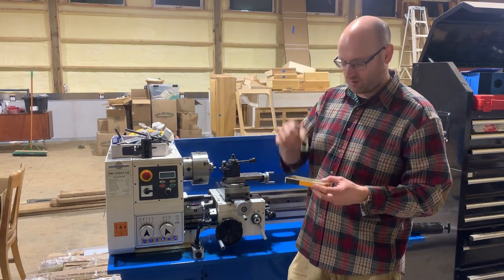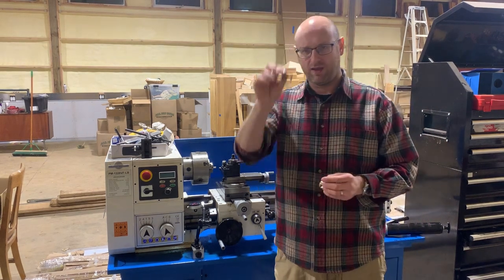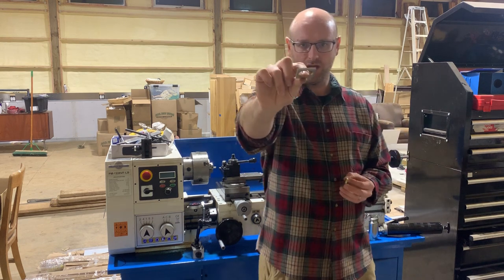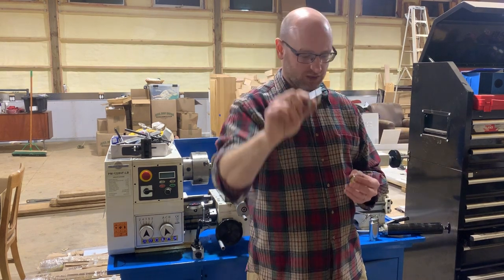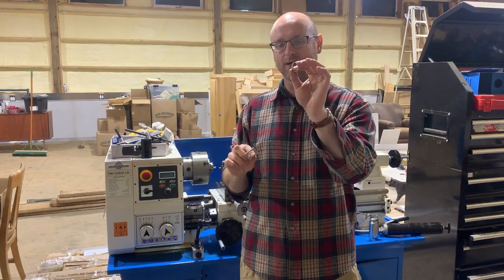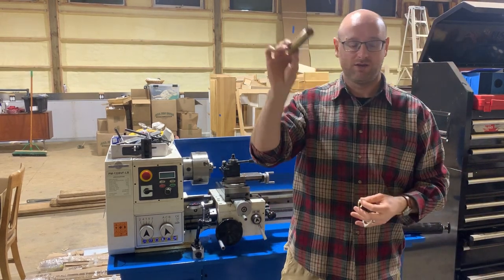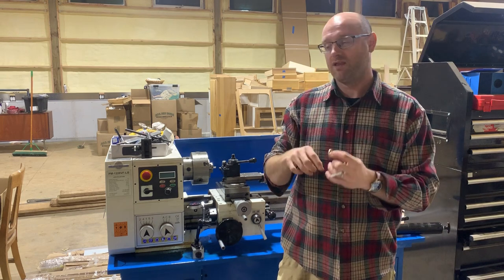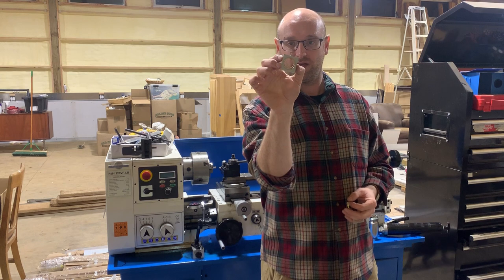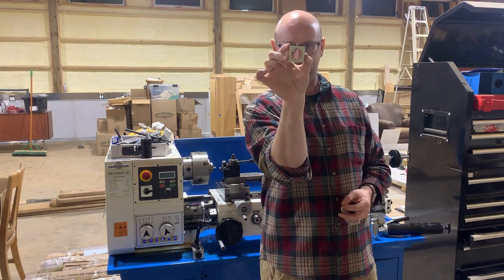So off camera, I finished off the smaller version, most of it. I think last time I showed you, I'd had this piece done, I've polished that, I've drilled a hole in the top, I don't know if that's gonna be in focus. Finished this guy, drilled a hole in the top of that. I held this guy, the full piece of pipe, in the jaws, and then drilled it, then parted it. In this first one, I parted it, then drilled it, and being so thin, it deformed a little bit, which is why it's not sitting in the center.